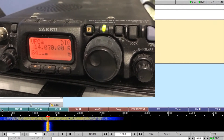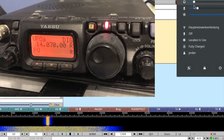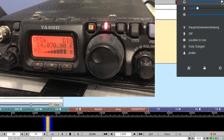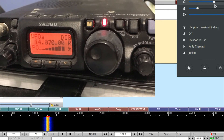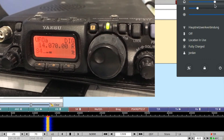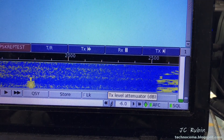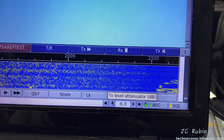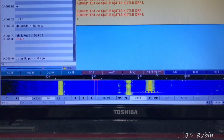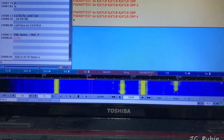I'll show another example — going too low gives us no power, we're not operating at full power. Going way too high is over-driving the radio. Once we find that sweet spot, we can use the transmit level attenuator shown on the bottom right of the FL-Digi screen to fine-tune the transmit power sent to the radio. At this point we're all ready to go — everything's configured, everything's working, all volumes are set. That takes us into the next video where we'll check out the performance of this FT-817 QRP rig.